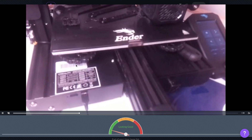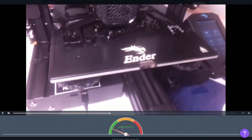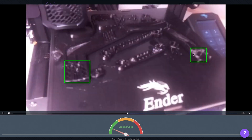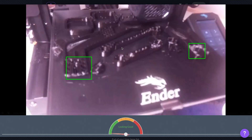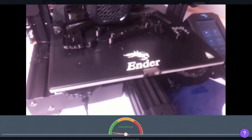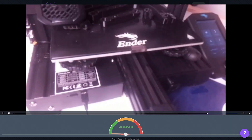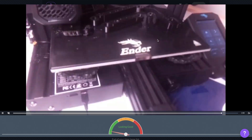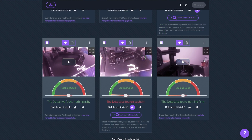It starts to look and say that something's gone wrong — you can see a little blob over here. It's detecting a mix of things that are normal, like over here this is actually just the grid infill, and it's putting a green box thinking something's weird. You can see it moving down the green into the fishy zone, definitely thinking it's detecting something. Even though a lot of this is actually legitimate, it tries to help but in some cases it's off. What ends up happening is it really does actually detect what goes really wrong and pauses it when it realizes something's definitely wrong. As we start to get a little higher it starts to spit out a bunch of filament making some real gooey mess — and you can see it all over. It found the spaghetti, so it paused that print for me and I didn't have to worry about that one.